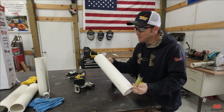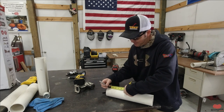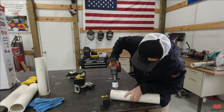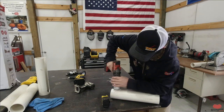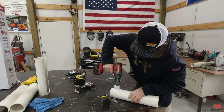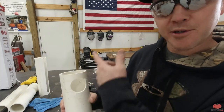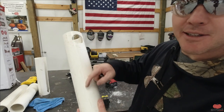Now that I've got my 15-inch piece of three-inch PVC, I'm going to measure inch and five-eighths, put a little mark there, and that's where I'm going to drill my two-inch hole. That gives us a nice five-eighths stop so the tools won't push all the way through. Now we need to get some marks on there and we'll take a jigsaw and cut this all the way through.